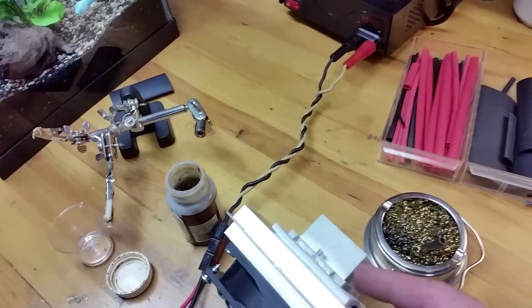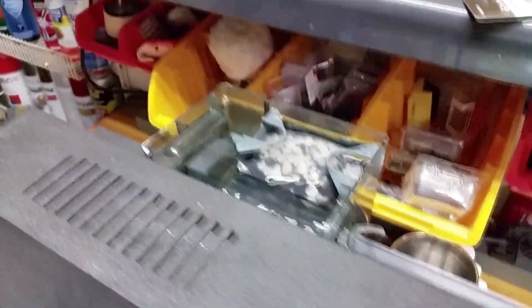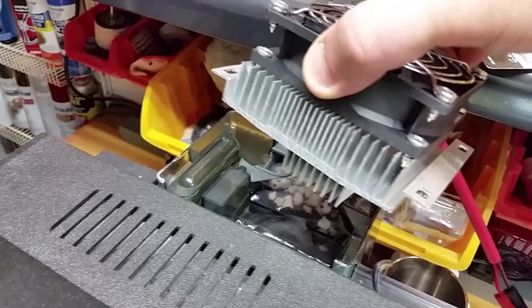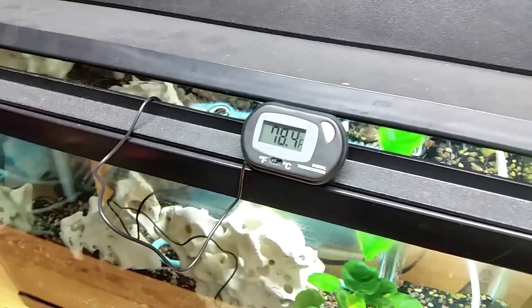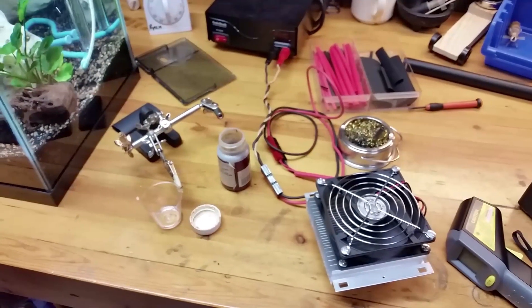What I'll do is this heat sink here can come over here. There's just a small Aquaclear that I have on this 10-gallon. I'm going to remove this cover, and then this is just going to sit down in there — I might have to modify those handles that pull out the media tray. It's just going to sit on top, and the water will flow across the cool side of the junction heat sink. Simple, homemade Peltier junction cooler.